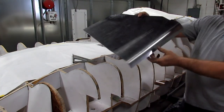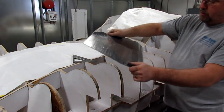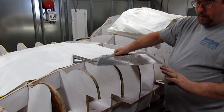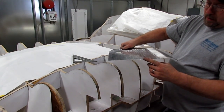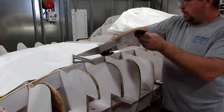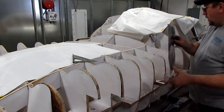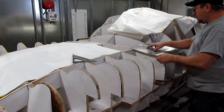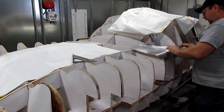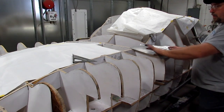I've got this piece all but finished. It has a little bit of rock in it — I've got to do a little bit of twisting yet — and I need to bring this radius down. You can see it comes up, has a little concave area here, and then it very slightly comes back up around. It's all about manipulating the metal the way you want it. Then you temporarily fasten that on there and tack a piece ahead of it.